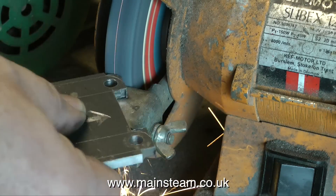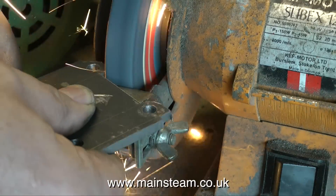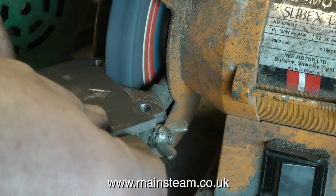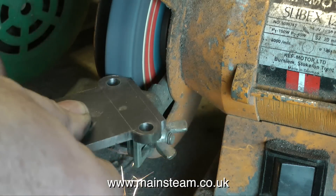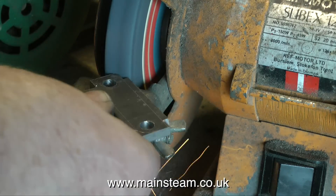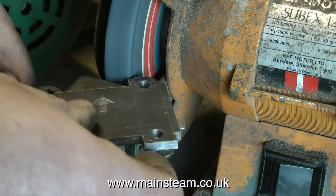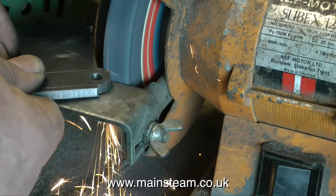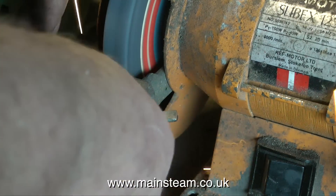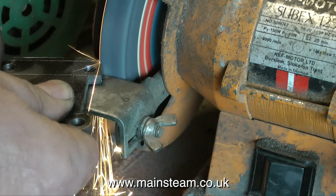This is a small grinder I have in the outer part of the workshop. I have a much larger one, but it's very brutal. This one's quite gentle, and if you put too much pressure on, the wheel stops. The milling machine left all the edges perfectly square, but I need to round them, and I'm doing this using the grinding wheel. Occasionally the work gets hot and I have to quench it in water - I always have a pot of water next to the grinder. You will notice in the video clip the wheel stops if I put too much pressure on, and the whole grinder moves up and down because it's not held down - I need to move it around where I have it in the workshop.